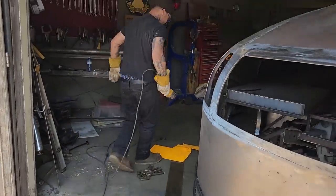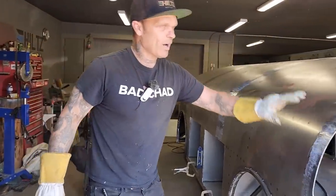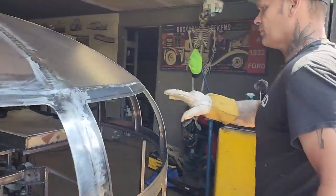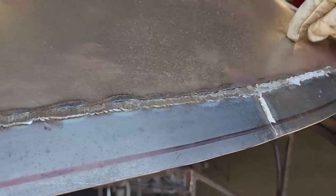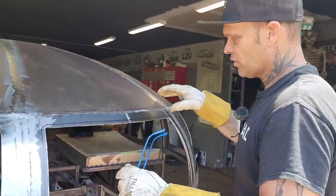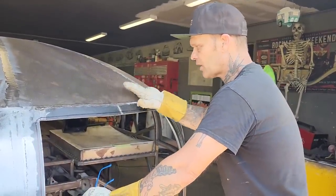Here's just a little thing that I do. This is the thing I do. Like, I always talk about when you butt weld something or when you grind the weld off, if we want to come over this side, I like when the weld is just ground, you just grind the weld. I like that. We're not hitting this, we're not hitting that. And I feel like that's the way it should be done. It should be, because if you're taking away from this and taking away from that, you're taking away product that's not necessary. You have nothing against it. It's good metal. Don't take away from it.